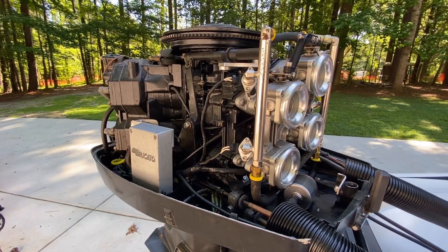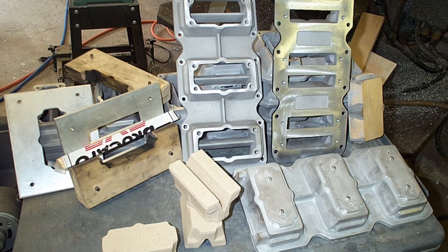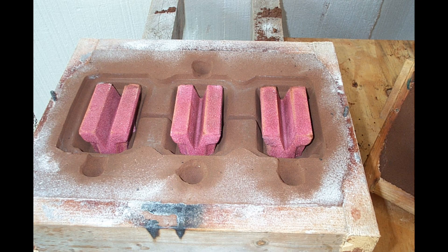From there I've made intake systems for several different models — Mercuries, Yamahas, OMC — and some custom projects that we've done for racers over the years. This is for those 3-liter reed plates I showed you. In the foreground you can see the pattern, and to the left some sand cores and the core box above that. The cores go into the mold cavity to produce the openings.